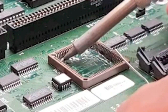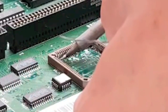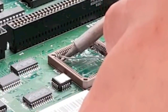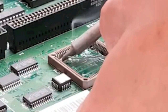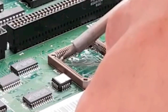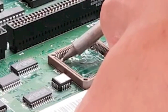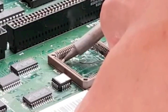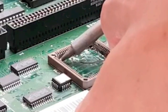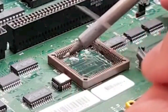I'm just dabbing into those pins with a bit of solder. The other thing you may have to do is add the solder at the time you touch the pin — that's the difference with these. If the tip on the iron isn't letting the solder flow down, if you melt the solder onto the pin directly then it's all right. Yeah, that one's melting now. The corner ones are the difficult bit — once you get away from the corners, things start to get a bit easier.